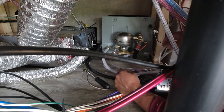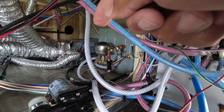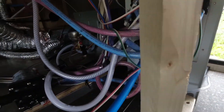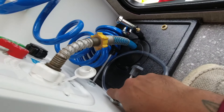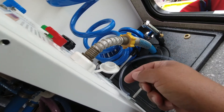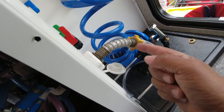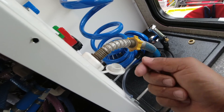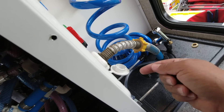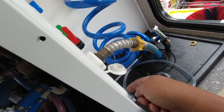What I want to do now is run that drain line from the low point of the tank and I want to run it down so it gravity feeds down. I want to probably put a hole down very low on the back of the board here and run it through so that it comes out the front of the waterboard and can drain through here when necessary. The reason I really want to put it on this board is so it never gets forgotten. We contemplated putting it through the floor and letting it hang like a low point drain for the rest of the camper, but I'm afraid because this is different and this is probably a one-off on this camper. So hopefully if you guys have this hot water heater, you're going to do something like this to prevent yourself from having any freezing issues. We're going to label it here so that they know what it is and it doesn't get forgotten in the future.